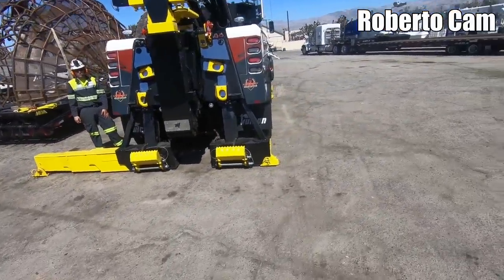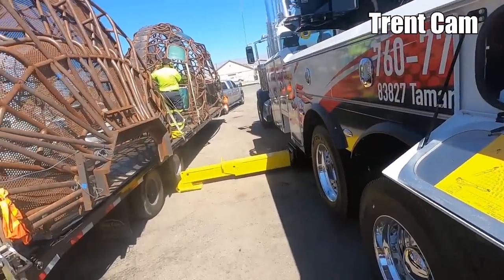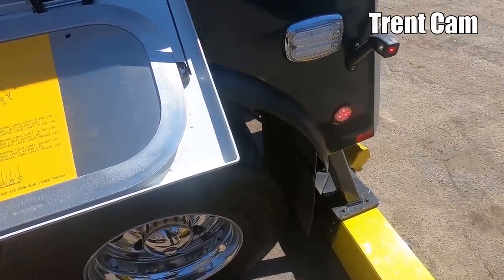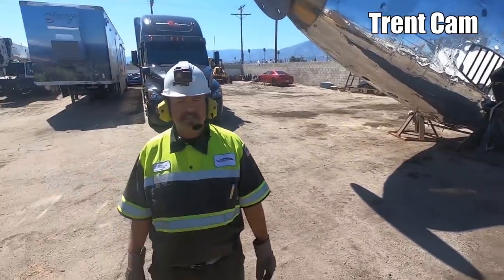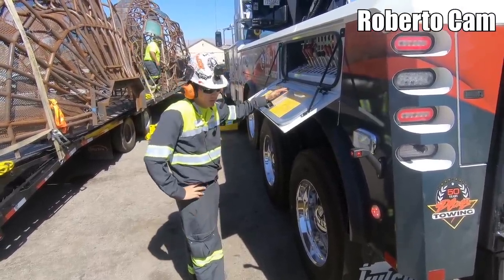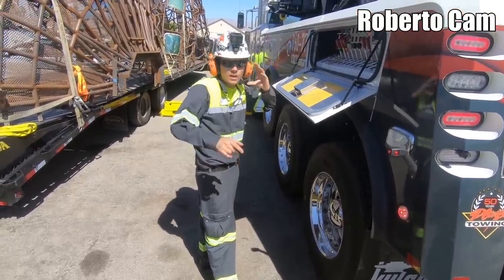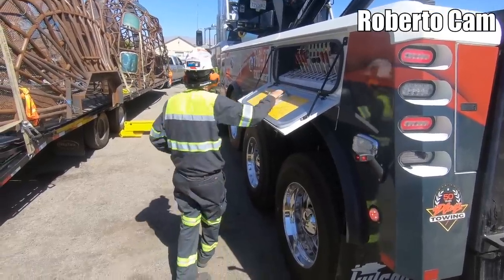You're saying it is idle though? Or all the air? Is that what that was? Yeah, that's all air. The truck's idling, isn't it? It's idle right now. This truck doesn't require high idle. The only time I put it in high idle is when I'm trying to put everything away. It just speeds it up a little bit. But this has a pump that adjusts to hydraulic demand. It makes noises, it adjusts the idle based on how much. Yeah, that's what it is.